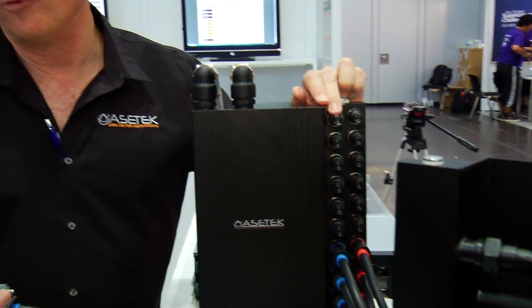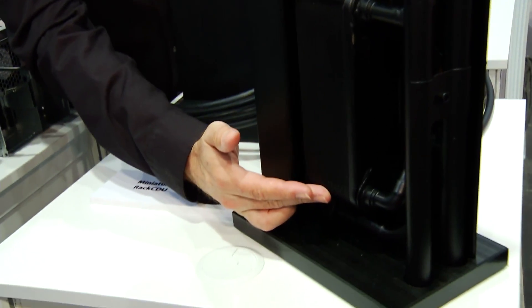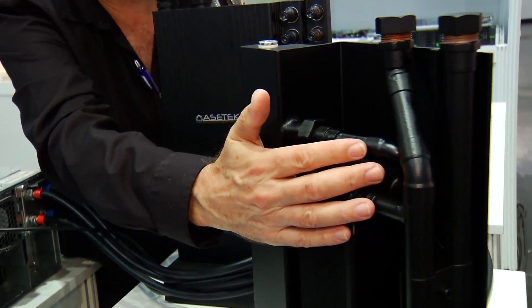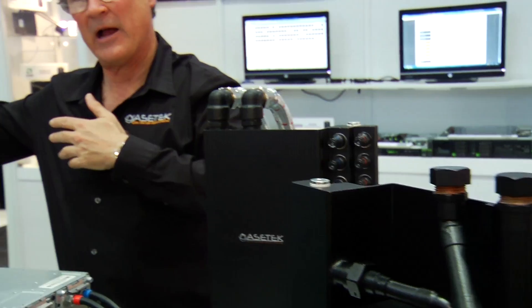These connectors inside connect to the connectors here, which transfers the liquid to and from this rack CDU unit. There's a cold water distribution and a hot water distribution — cold water being 104 degrees Fahrenheit. These two manifolds distribute the water into this liquid-to-liquid heat exchanger, where the heat is exchanged between the server liquid and the facilities liquid. The water doesn't mix — the water running in the server side doesn't mix with the facilities liquid. Water comes in at 104 degrees Fahrenheit and out at 138 degrees Fahrenheit. This whole structure is then integrated into the rack.